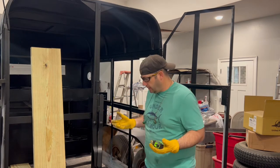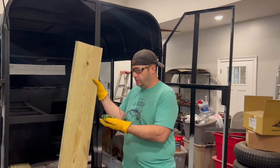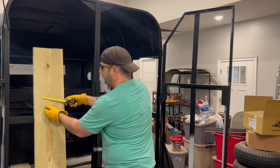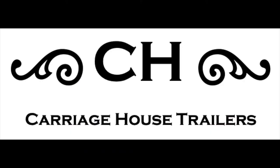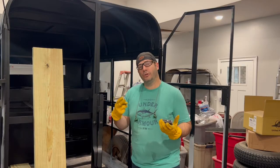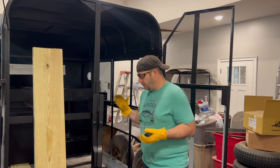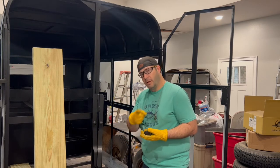Today I want to show you how I install the floor. I'm going to be using treated 2x10s, which in reality are an inch and a half by nine and a quarter. They're not truly 2x10 like they used to be in the good old days. So I'm going to show you how I'd go about that so you can do it too. Let's follow along.